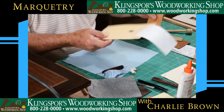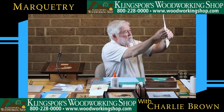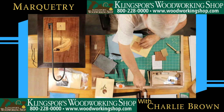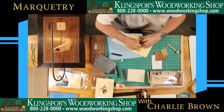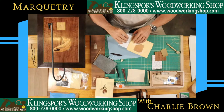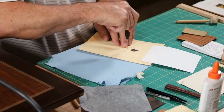Okay, now I'm ready to put my piece on the back. Make sure that I cover that, put it over here in the corner so I'm not wasting a lot of veneer, line up the grain the way I want it, and put some tape across it. I'm going to use another piece here because it's curled a little bit and I don't want it flopping around. Okay, go back over, find the piece that you can find a place to put the hole in.